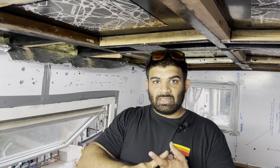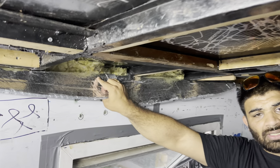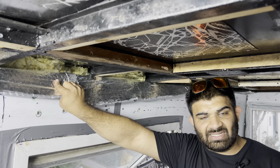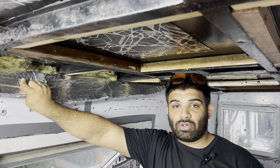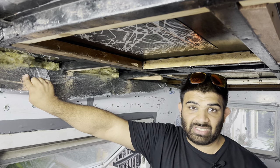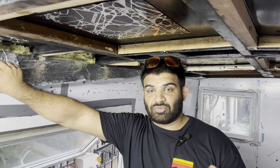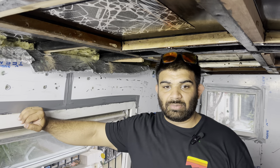So this makes our layer number 1 — this is the 2.8mm damping. Then comes the rock wool layer. The PUF foam that we see has basically the same effect, but the best part about rock wool is that it is a fire retardant material — it does not catch fire; rather, it actually stops a fire from spreading. So this has multiple, multiple benefits and has been filled all through.